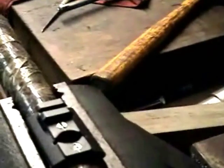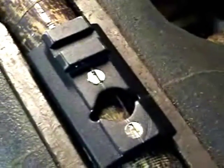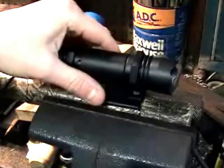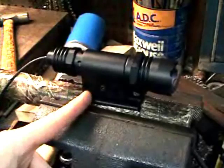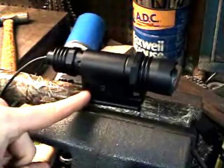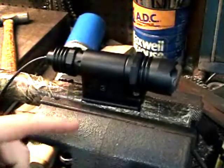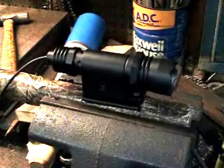There she is, all mounted down — you can get an angle on that. It's extremely solid; it won't be moving. Not like there's a lot of kickback with a bow to vibrate it loose, but that's on there extremely well. Here's the light all mounted down to the stabilizer bar — very secure mounting. The problem lies here: we don't need both little screws going through. We only need one, because I want to be able to take it on and off, so I'll drill this out and tap it for a thumb screw.